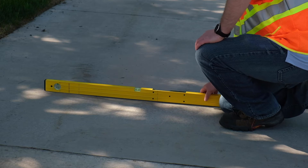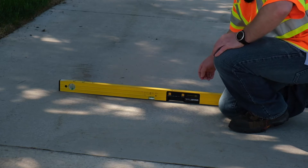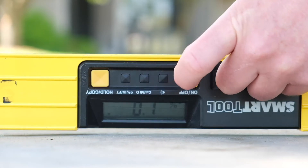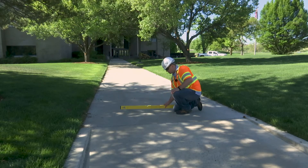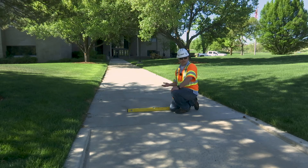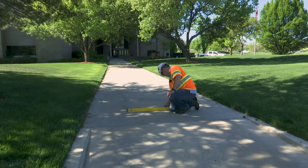It says Cal 2. The next step is to flip it over so it is upside down and the display is facing you once again. You wait for it to normalize, then push the calibrate button, and the display will show Cal 1. The final horizontal step is to rotate the level 180 degrees so the display is facing away again. Note that if it's not level enough to be calibrated, the tool will show three dashes on the screen when you try to calibrate it. It's showing Cal 1 and 2, so we are okay in this case — push the calibrate button and it shows Cal 2.